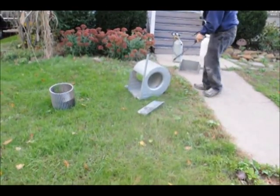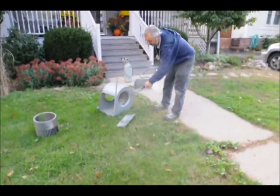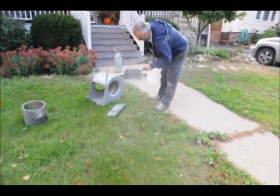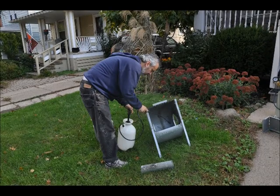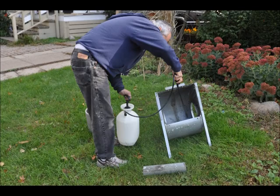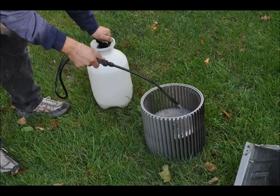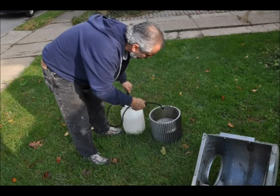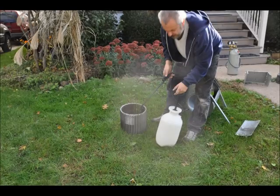That's the soap, right? It's like a chemical — a coil chemical. It cleans coils on air conditioners and it takes this kind of stuff right off. The cleaning solution is sprayed into every nook and cranny. The blower fins are also sprayed with the cleaning solution. This cleaning solution breaks down the dirt, dust, and grease. It's the same solution you would also use to clean your HVAC evaporator coil.